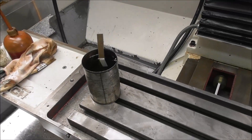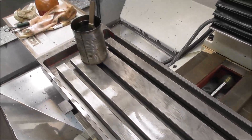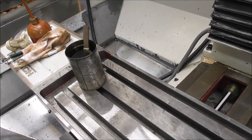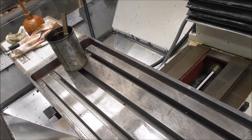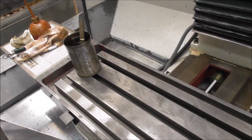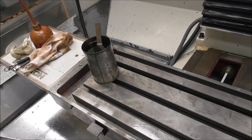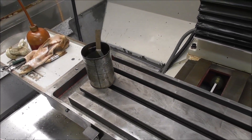I know the advice is to stone down the surface of your table with an oil stone and kerosene from time to time before this type of work, but it's a bit of a two-edged sword. You're leaving behind a residue of the worst kind of abrasive material — aluminium oxide or silicon carbide — and you want to make sure it's really carefully wiped up including between the slots, because it'll overflow down into the T-slots and eventually get into your coolant, slideways, and ball screws, increasing wear.